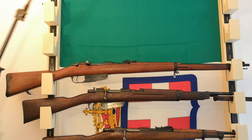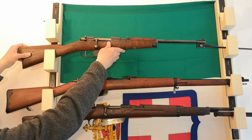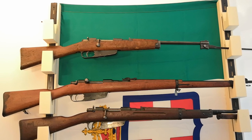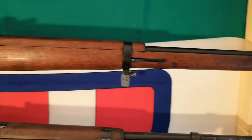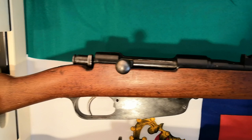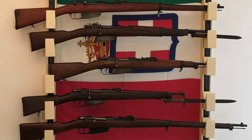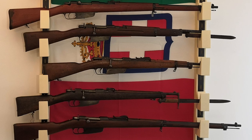The 91/38 was specifically designed to be made using as many salvaged parts as possible coming from the older versions, and as such the shorter carbine versions were recycled as well, giving birth to the short Moschetto 91/38, of which you can see the cavalry variant here. The most obvious difference with the previous models is the much simpler rear sight — an unadjustable 200m fixed sight. Between the 91/38 rifle and carbine I put the 91/41 rifle, the last iteration of the design, extensively produced during WWII and mainly intended to be used on the Russian front. The solutions introduced with the 91/38 variant were abandoned, and the rifle resembles much more the original Model 1891, with its long overall length, the straight bolt handle, and the double rear sight with a fixed notch set for 300m and an adjustable one that goes up to 1000m.